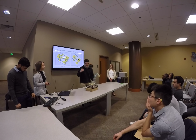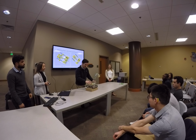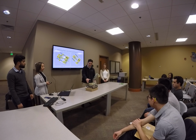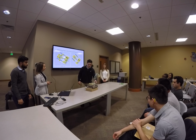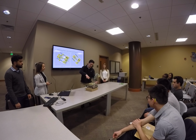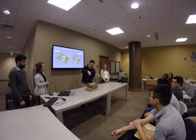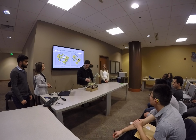And then next, one of the most important parts of our excavator is the rotating plate on top here, because it encases all of the main components of our excavator, including the arm and the syringes to drive the arm. So in designing this, we have a spot for the servo to connect to and rotate. We mounted bearings onto it, and we designed little holdings for the syringes to stay onto the base so that in motion they wouldn't fall off.